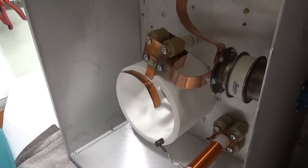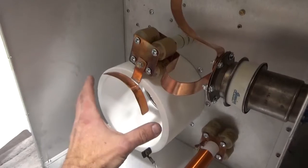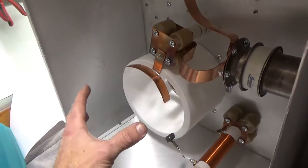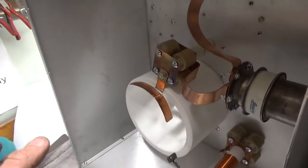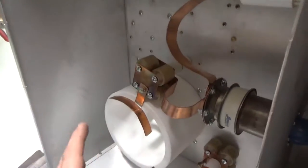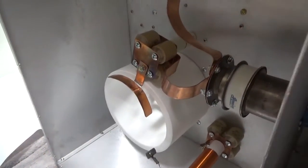Another reason why broadcast amps usually use a chimney around the tube to the floor, and one on the top of the tube going out the cabinet — that's to keep contaminants out of the RF deck, even though they'll usually use a filter. It keeps contaminants out because they're mainly just blasting the air right through the tube and right out the amp.